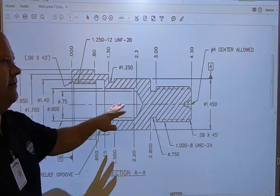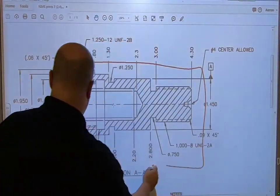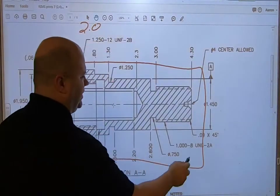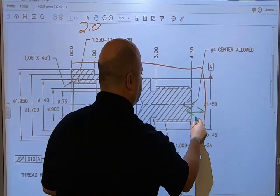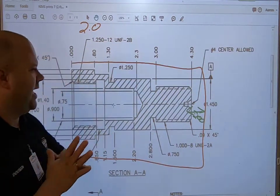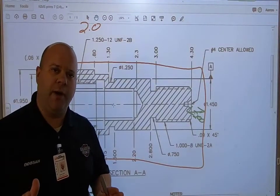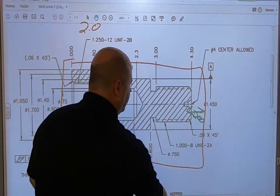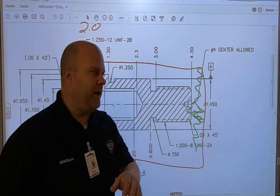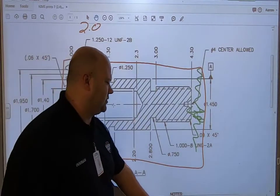The first thing I want to go over is the part I have. Starting with raw material — I'm looking at a two-inch raw material, and I have two hundred thousandths until I get to my finished length. That means I have roughly a hundred thousandths on both sides of my part that I need to clean up. G54 will take off one hundred thousandths on one side, and when I flip the part around, G55 will take off a hundred thousandths on the other side.